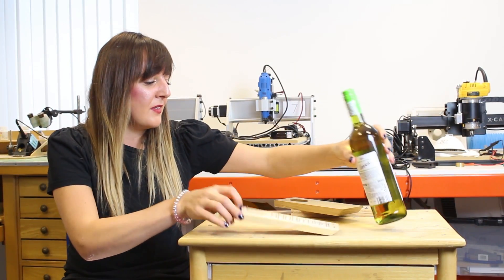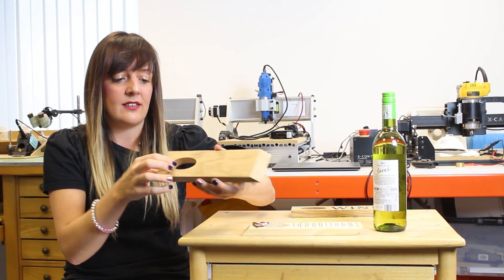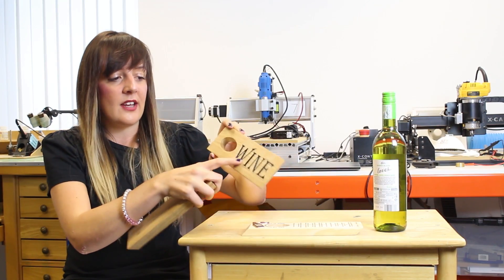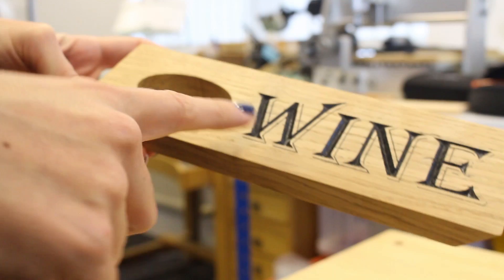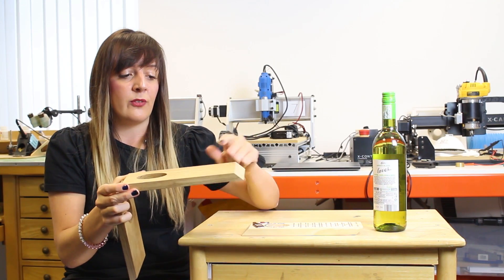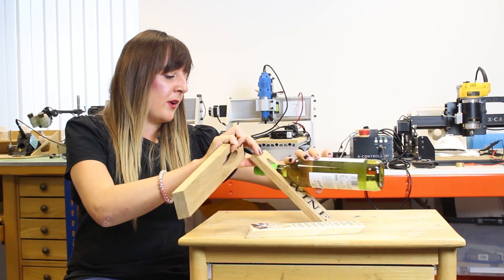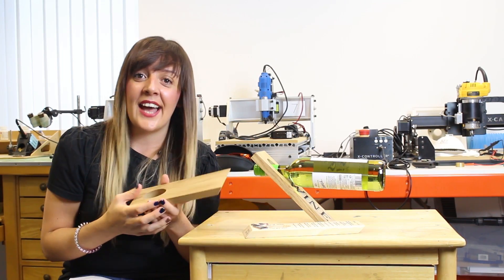The two that I've made — I've made a plain one which has a straight oval cut and a 45 degree angle. I've also created another one as part of a two-sided machining operation, where we have text on one side using simple V-carved text with a V-bit, and then we've got our V-bit cut for the 45 degree base, and that simply works like this.